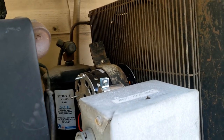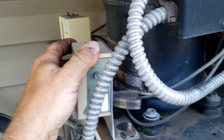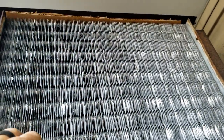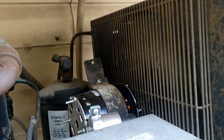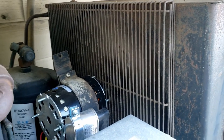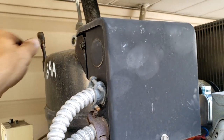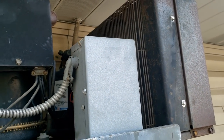Unfortunately I couldn't catch it all on video, but we've got a full sight glass. Checked the pressure switches, got the new motor in there — labeled and grill back in. I blew this all out with nitrogen and put a little piece of cardboard to keep it from rattling. This thing is beyond tired, but it's still running. Got the inside cleaned up, fans running — fan blade has just a touch of wobble since it's not new. In my area everybody wants to just fix things — that's how it is around here.